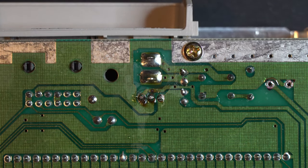With our voltage regulator installed, we can move on to the next step, which is installing some of these capacitors. So let's start from the back of the board. We'll start with C13 here, the 1000 microfarad capacitor. Make sure you align it with the labels on the board for negative and positive. Just slide that all the way through. Spin that around. We're just going to tack this in place real quick.